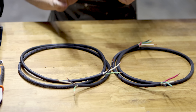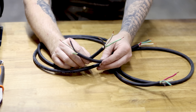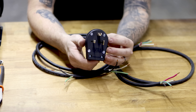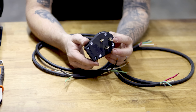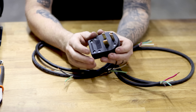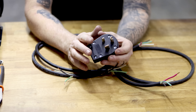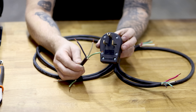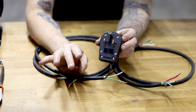If you're doing 220, the wiring configuration is identical — we just have to add our own plug end to the 14-3 wire. This is the 220 outlet plug end, available on Amazon for about twelve to fifteen dollars. You'll see some versions with a fourth pin — that's for dryers and certain appliances — but in our case we only use two hots and a ground, which is why we have three wires.